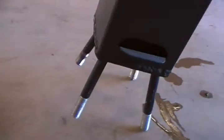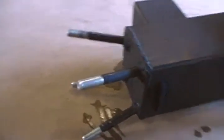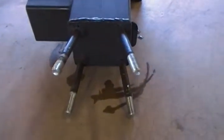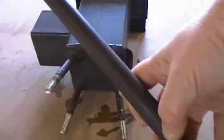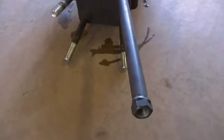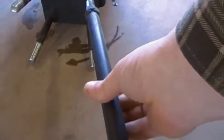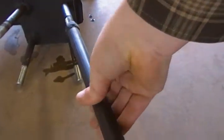Now where the Deadwood stove has legs that look like angle iron bolted together, I tried something different. I used some bolts, cut them off so the angle at the top would be the same, and then welded them on. That allowed me to use some black iron pipe. On a flat surface, I can just slide the legs right in. On an uneven surface, I welded a nut at the top so I can screw each individual leg to a different height and adjust for any inconsistency in the ground or the surface it's sitting on. I was pretty happy with that.